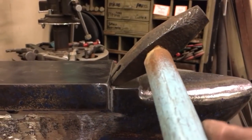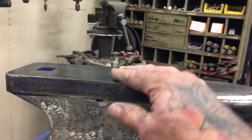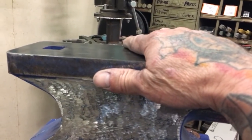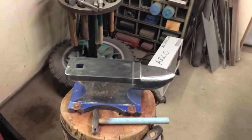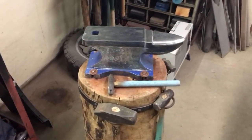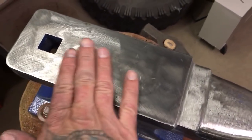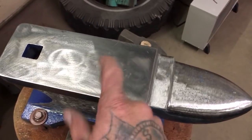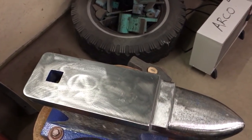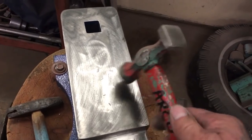You can pick up these shapes on the horn too — if you're making fenders, hoods, doors, bottoms, edges, or any panels it just makes the work so much nicer. Anyway, 55 pounds for 55 bucks — a buck a pound at Harbor Freight. Pick one up if you're doing what I do. If you're doing professional blacksmithing, forget it — I don't think this is hardened at all because it leaves marks really bad when you hammer on it. But it's perfect for hammer and dolly work and forming sheet metal.